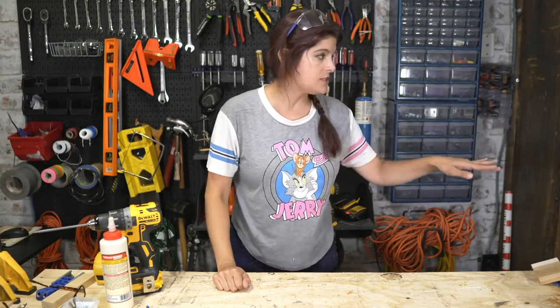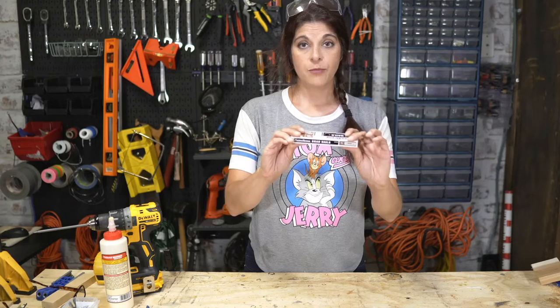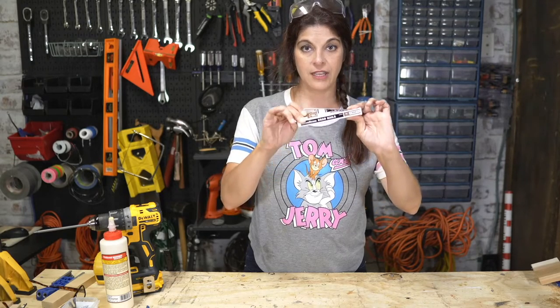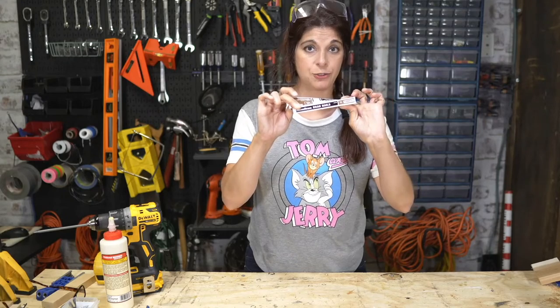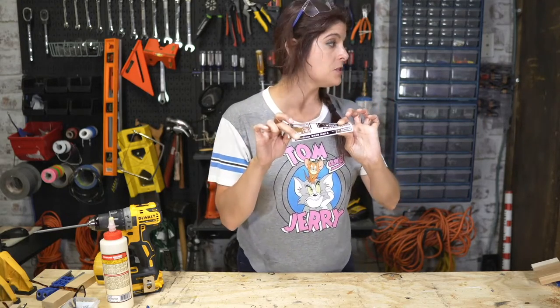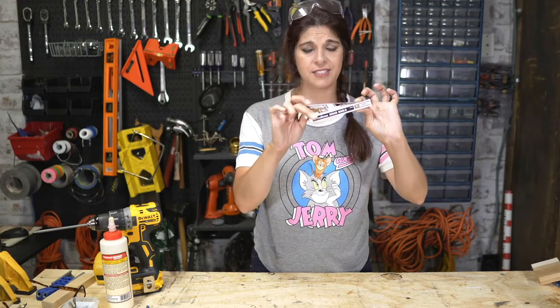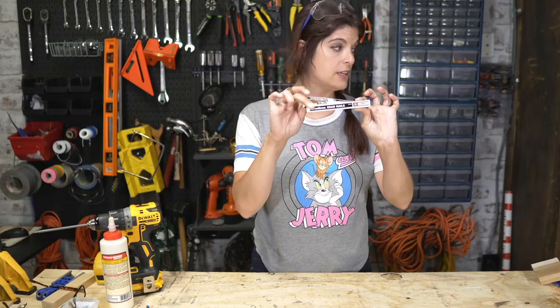So not too much. Like the two boards there, say this is the board right here. Those two pieces in particular have a natural twist like that. This is exaggerated, but they have a natural twist. Now, if I had a planer, I'd stick those things through a planer to make sure that the boards are perfectly untwisted. This is an exaggerated twist. So that's, I think, what you're seeing.